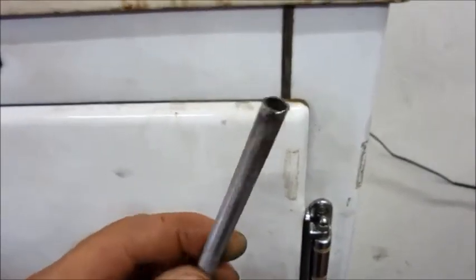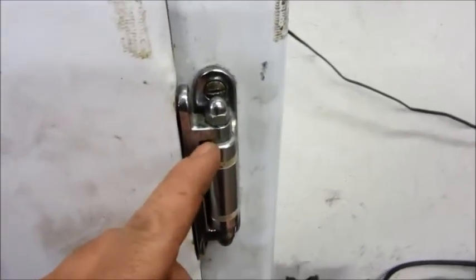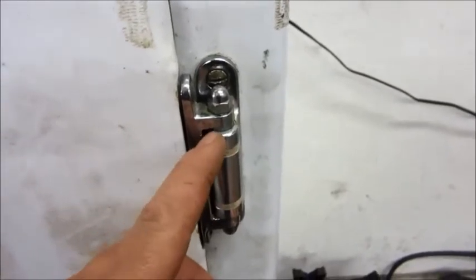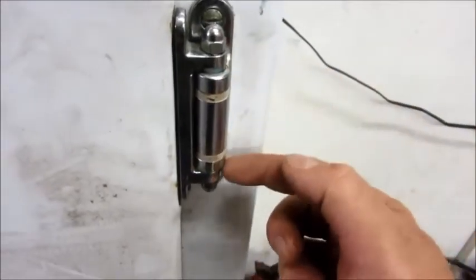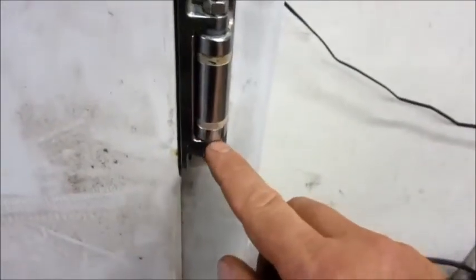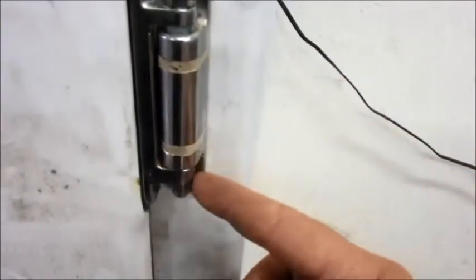I had to repair that, and what I did was make a bushing out of 5/16 steel brake line, and soldered it in. I had ground it out where it had a good surface and used hard stay-bright solder. Now there's a steel bushing that goes all the way through this part, and the little ears on the other part of the hinge also have short sections of bushing of that same material.